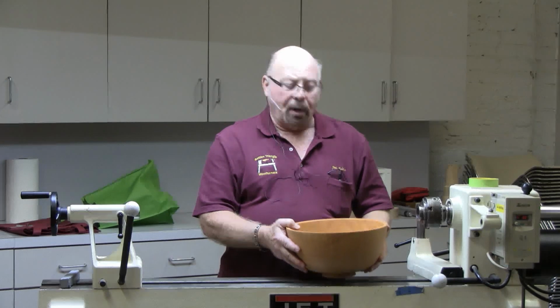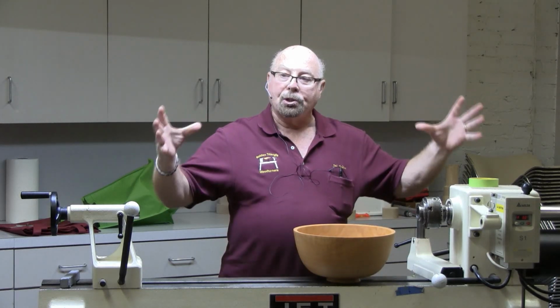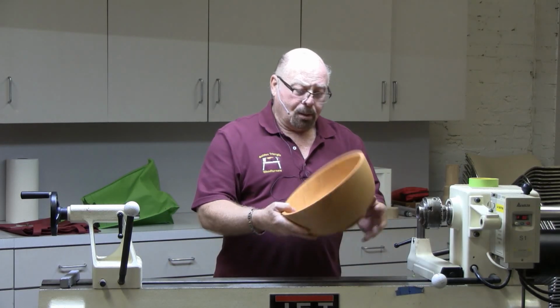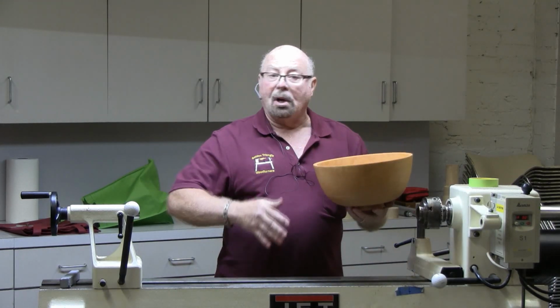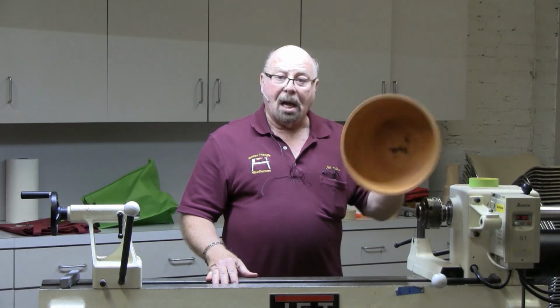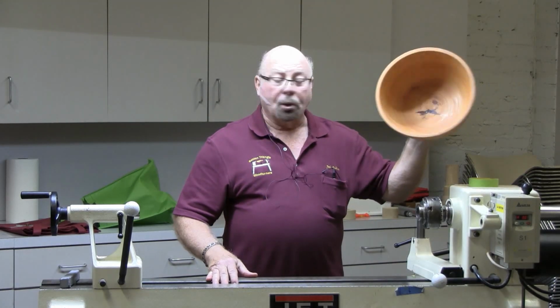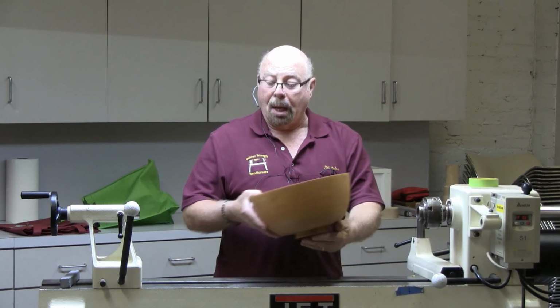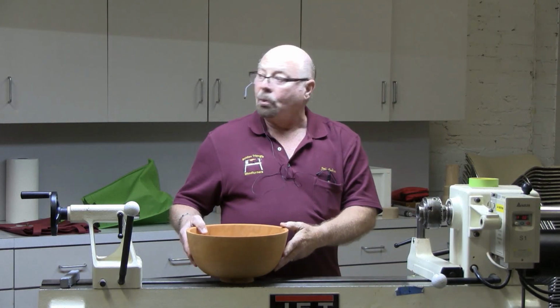And the freezing and thawing action apparently allows the moisture inside the wood to come out. And then once the wood was finally dry, after just a few days, I put a finish on it. This bowl is now over a year old, and no distortion and no cracks out of green wood. I've done this now a number of times with lots of different wood.